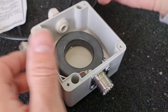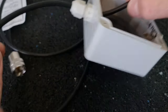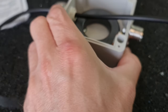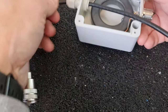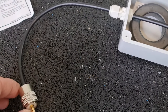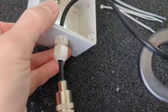So the first very important thing is to line this coaxial cable through this transition, and then we have to wind the toroid. The reason why it is good to first have this coaxial inside the transition is that here on top I have already prepared the PL259. So I have to leave a few centimeters long connection, secure this transition, and then we'll wind this toroid. So let's get started. So that is the space for the end.